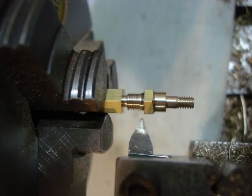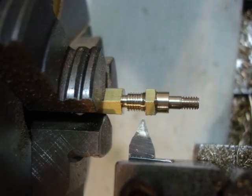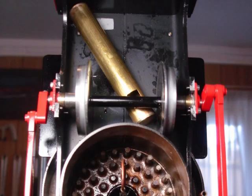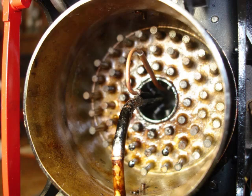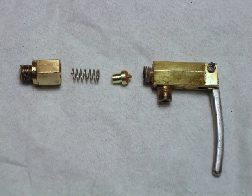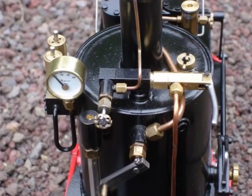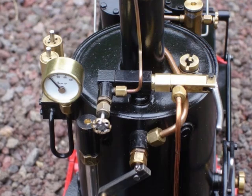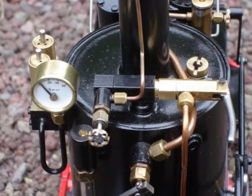This is the footplate steam fitting for the whistle — I proudly machined it all in one go. The underside of Jack showing the whistle in place; the longer the whistle the better. Also showing the blower and exhaust pipes. A new iteration of the whistle valve, showing a shuttle with an O-ring for sealing. Eventually I found that the loco would reach a boiler pressure of 30 psi when running slowly, so I fitted a 0–60 psi gauge as I like to see the needle vertical.